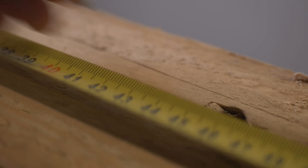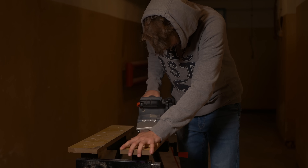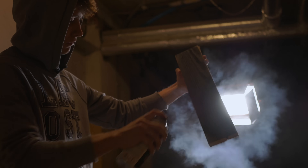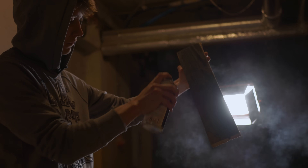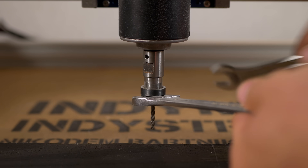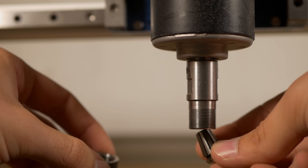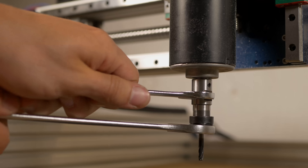Object number three: an industry label or logo, 40cm wide. I painted the top of it black so that we will have black letters on the top and clear wood on the bottom. I will use a 4mm milling bit, so I had to change the collet inside the spindle, and I also decided to go slightly more aggressive with feed rate and depth of cut.